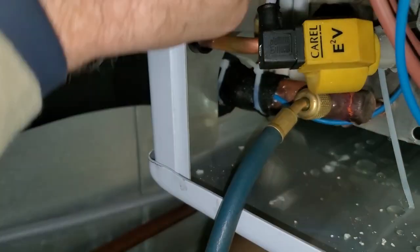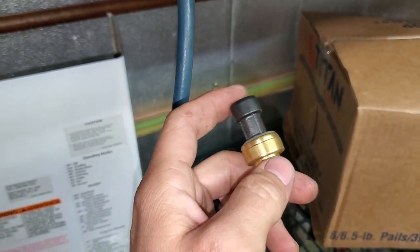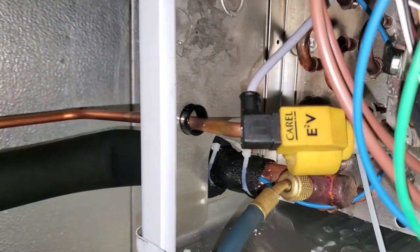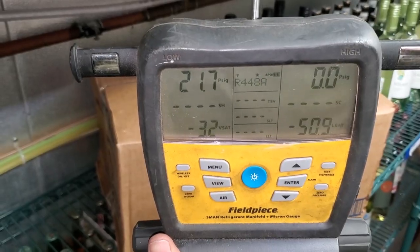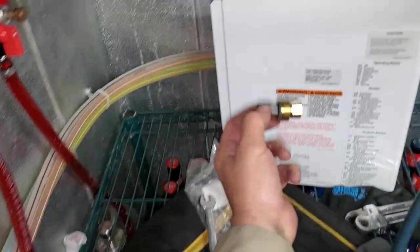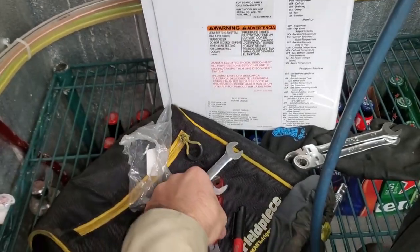To pull your information, there is a Schrader port underneath the pressure transducer. I pulled it off and it kind of makes me wonder — I can't remember what I pressure tested to. It actually tells you right here: do not exceed 150 PSI. I can't remember what pressure I pressure tested to. Local supply house had one — I've got one of my guys going to get it right now. He'll be back in 10 minutes and we'll get it put on there. Now it's reading accurate. We're at 21 PSI. We're going to let the thing run and make sure it doesn't shut off on a safety again. It was just this bad pressure transducer. I'm going to review my footage because I don't remember what I pressure tested at. Luckily my supply house had it — I'm probably going to stock these just in case.